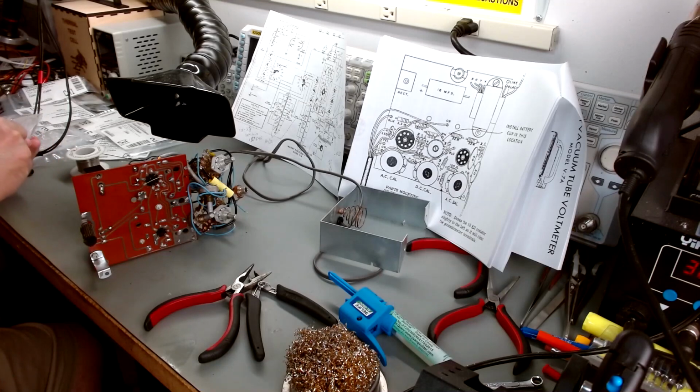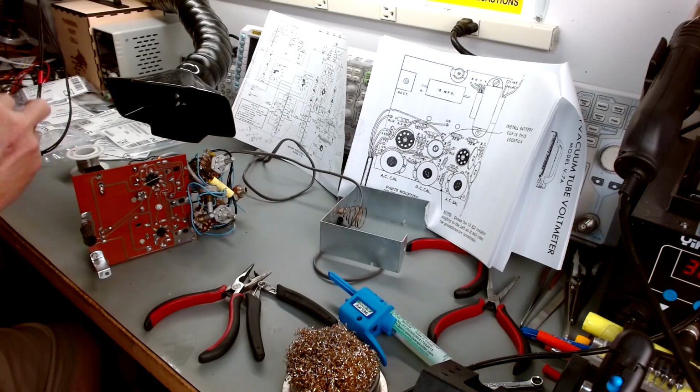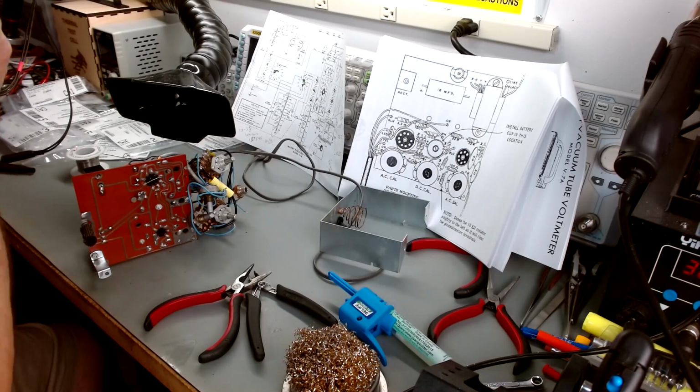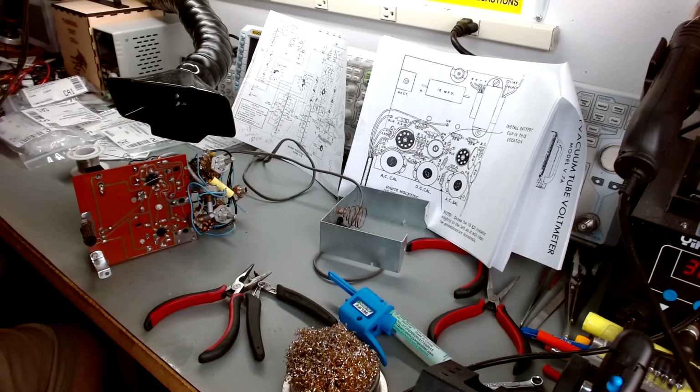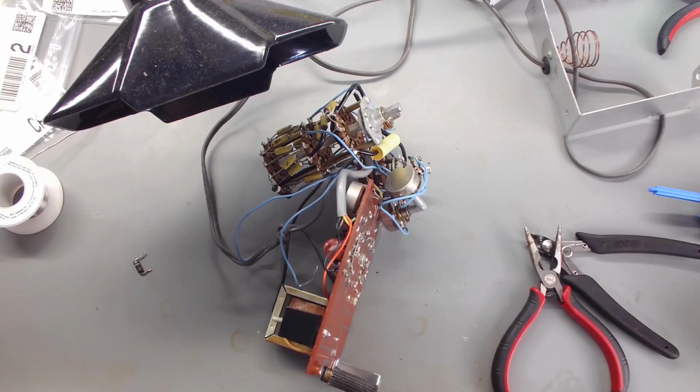As I said, we're trying to improve this thing. So in the case of this one, even though that was reading 150 once it was out of circuit, these metal film, low ppm, more thermally stable resistors won't drift as much. 149.99. Nope, wait. 150.01. That's what I'm looking for.